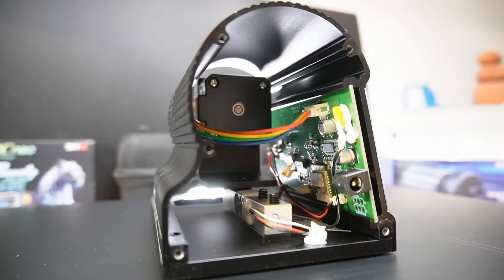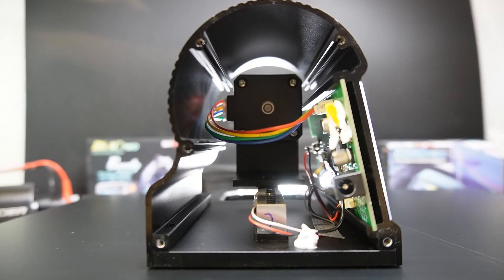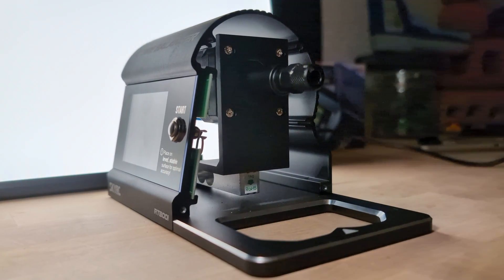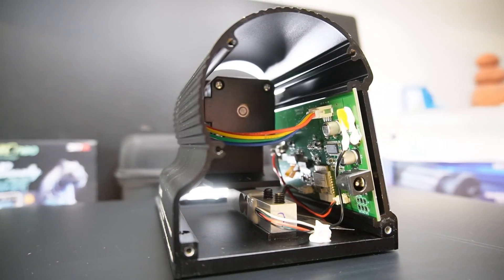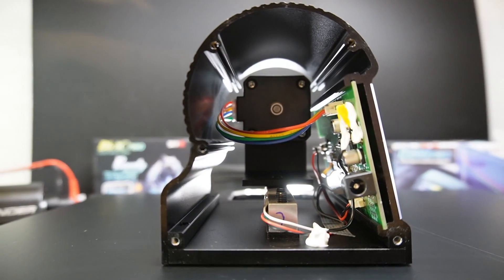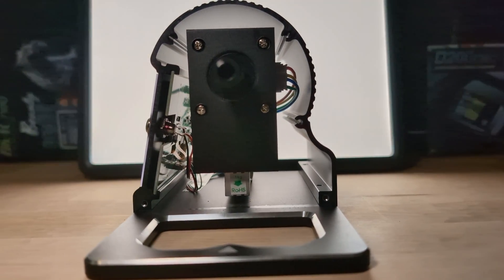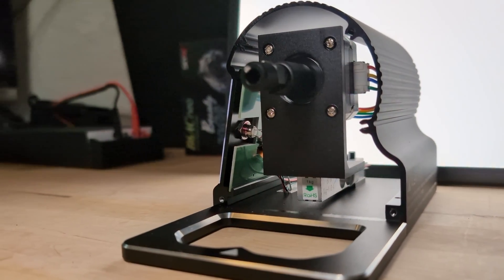I was pretty curious about the exact design of this device, so I decided to take a closer look by opening it up. Here you can clearly see the load cell at the bottom, and above that, the entire motor assembly with the shaft mounted on it. About the 0.2 gram accuracy — it might not sound super sensitive, especially when some scales go down to a milligram. But those ultra-sensitive scales can only handle up to 20 grams, while the load cell in this balancer can manage up to 1 kilogram because it needs to support the motor and the wheel with its adapter. So it's a trade-off, but it turns out to be just right for balancing needs.